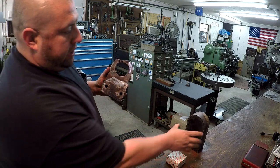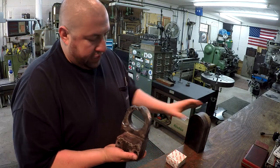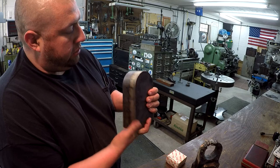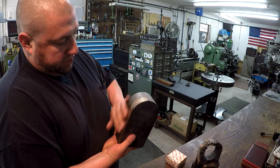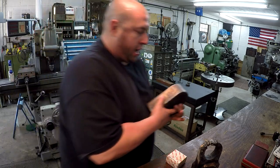I've got a piece right here. This is 2.5 inch A36 hot roll plate that was flame cut, and they did a great job on the flame cut here. This was from Alro Metals out of Orlando, and we always get them to do our heavy cutting like this, and they always do a great job. Nice clean edges there. We'll have a little bit of cleanup to do right there with a grinder before we get started.